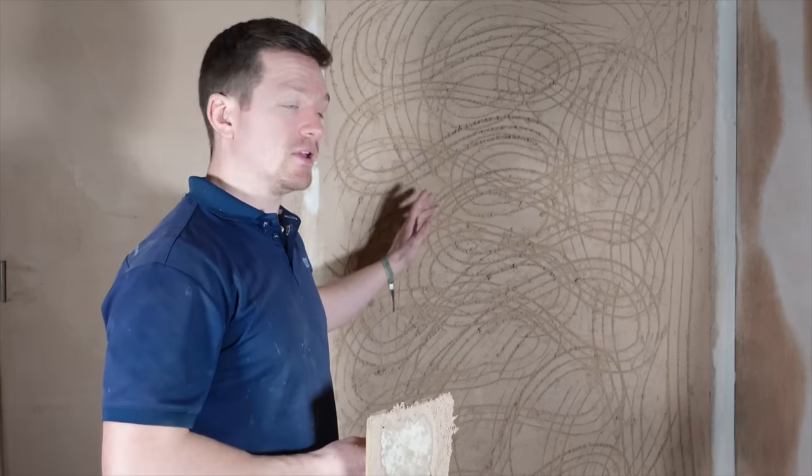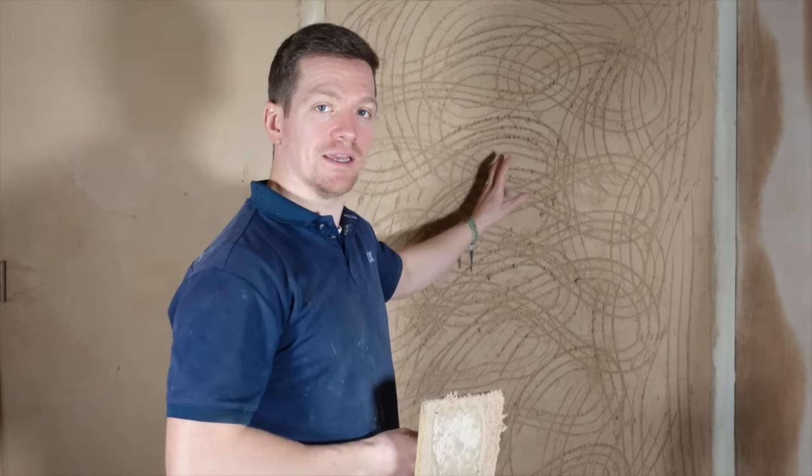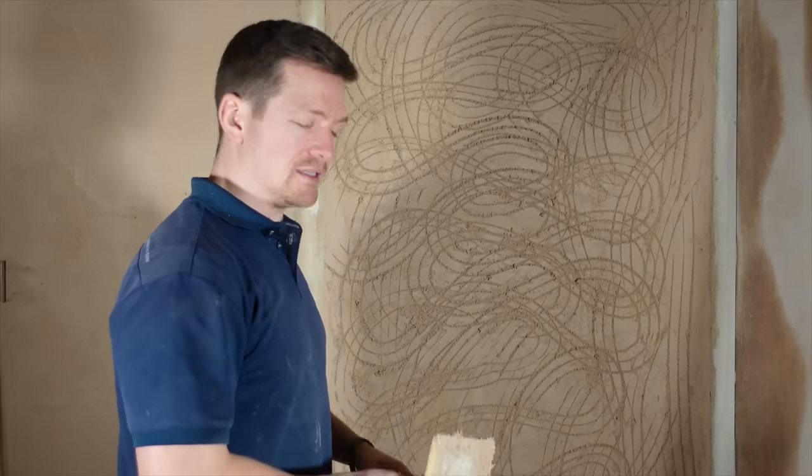And there it is — that's your wall. It's been floated, it's been flattened. We've also applied a mechanical key which means it's now ready for the top coat, the finish coat of plaster. Your wall's floated, it's scratched, you've got the devil's float key ready for the top coat. Now usually what you do is wait two to three hours — depending on temperature, wait for that to fully dry — then put your finished plaster directly on top. To see that process, click that video here — I'll show you the full way to plaster a brick wall. Subscribe here. Thanks a lot.